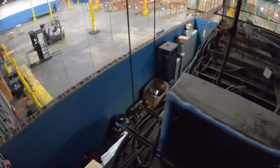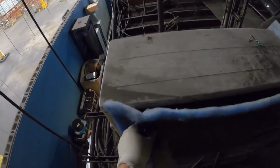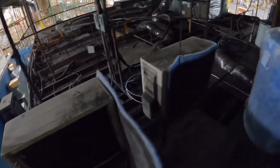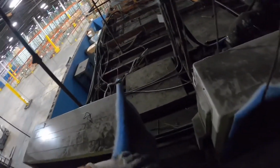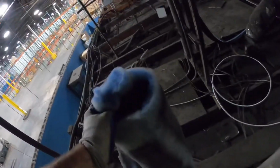I'm going to go ahead and put some new media on here. First, I'll pull these ones off. It looks like we're just using some wires, this way it's reusable. It's good enough to hold it on. It doesn't need much strength. As you can see, when I pull these off, dust is really going to start coming free, so I'm just going to roll them up gently. I'm actually wearing a mask right now, one for COVID, but two to not breathe all this crap in. Just try to do it as gently as possible.